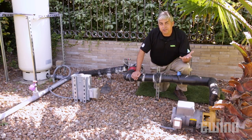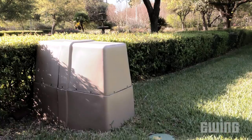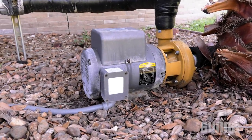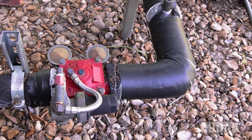This particular commercial property is 80 acres and has over 200 irrigation zones. Because of the large expansion over the last several years, we've had to add an inline constant pressure booster pump. The water comes from the city at about 40 psi, goes through the pump, and comes out at about 80 psi to make sure the lawn sprinklers operate properly.